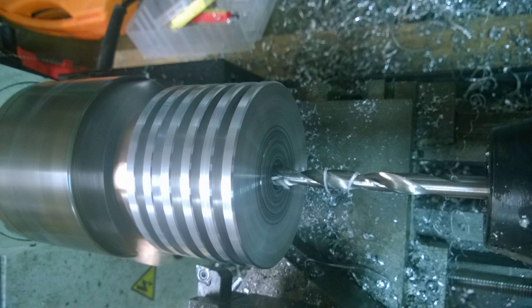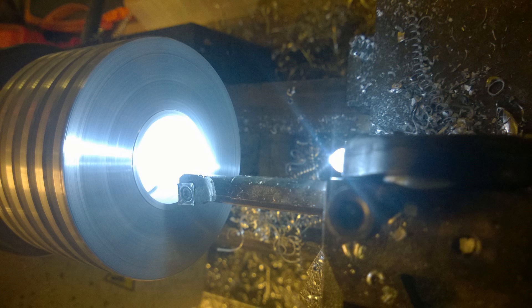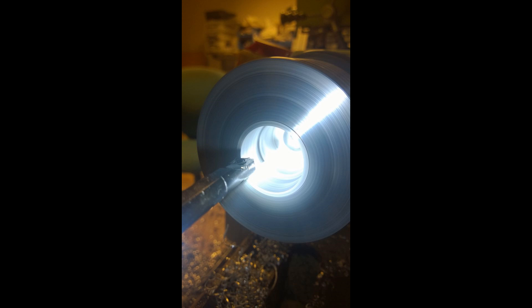Then I'm ready to bore the cylinder out, making it slightly undersized so we can just press the sleeve in. You can also see I've come in with a chamfering tool and chamfered all the fins so they're nice and not trying to kill you. Boring this out took absolutely bloody forever — the machine doesn't have much torque and the boring tool is tiny. I opened it up pass by pass. I got some shots with a little LED light so I could actually see inside — it's quite dark, it's late at night at work with all the lights off, but it's nice to sit here and do this while everyone else has pissed off.